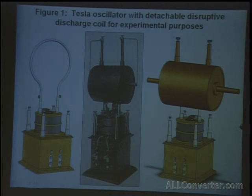In figure one is shown one of the earliest forms of oscillator constructed for experimental purposes. The condenser is contained in a square box of mahogany upon which is mounted the self-induction or charging coil, wound, as will be noted, in two sections connected in multiple or series according to whether the tension of the supply circuit is 110 or 220 volts. From the box protrude four brass columns carrying a plate with the spring contacts and adjusting screws, as well as two massive terminals for the transformer. Two of the columns serve as condenser connections, while the other pair is employed to join the binding posts of the switch in front of the self-induction coil and condenser. The primary coil consists of a few turns of copper ribbon, to the ends of which are soldered short rods fitting to the terminals referred to.